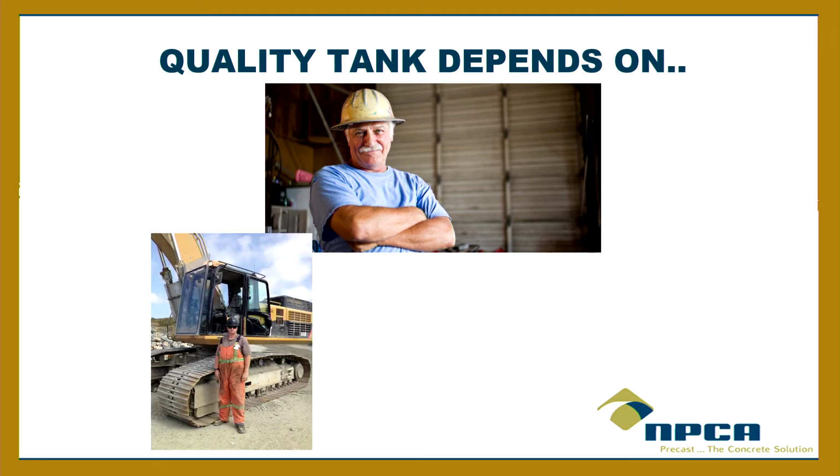So we're talking about quality tanks. We're talking about tanks that are watertight. We talked about water tightness. We talked about strength, the 4,000 PSI or above, 5,000, 5,500. If the minimum is 4,000, then chances are they're not aiming for 4,000. They're aiming for higher. And the way they test it, if you've ever seen a compression test, they put a cylinder in a machine, they squeeze it until failure, and that gives you the strength of the concrete.